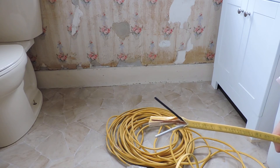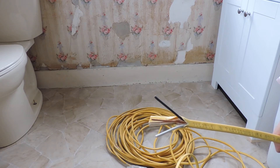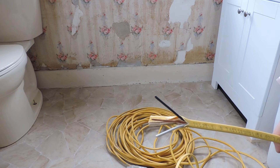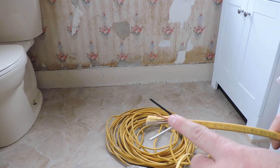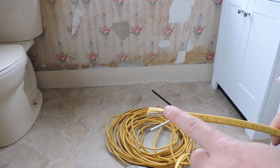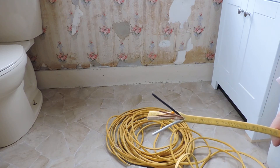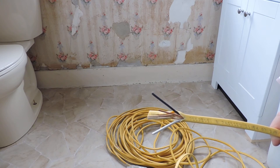We have a national electrical code in this country to try to standardize how wiring is done — that's for safety's sake, and it gives electricians the ability to do things the way they're supposed to. In most, if not all, electrical applications, the bare wire here is the ground. It doesn't need extra insulating because it typically won't be carrying any electric load. It's there for safety — to handle any shorts or to trip a breaker if something goes wrong with an electric circuit.